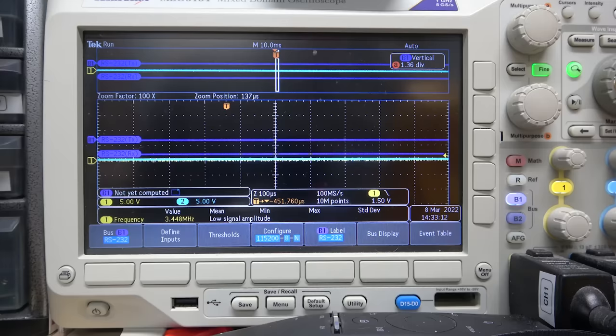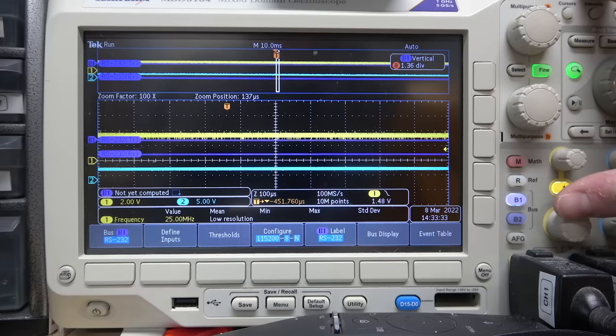All right, so both of the serial lines are low until I go into Python mode, and then they both snap to attention. So yeah, it's 3.3 volts. That's what you'd expect. All right, let's try to capture something.